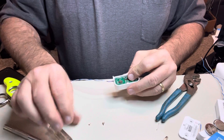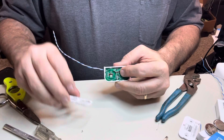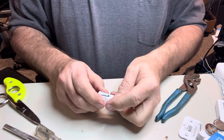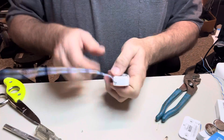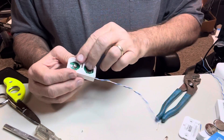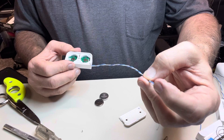There — went right in that time. It's funny how things like that go. Now this piece goes back in also. Here's your tamper switch — that way if anybody removes the cover it'll send an alert that somebody's tampering with it. You want to make sure that lines up back into this groove in the middle — that's what snaps it all into place. There we go, all back in place. Now hook this end up to your house wiring — the one that's already pre-wired into your house — put the batteries in, put the cover back on, and pair it with your system.